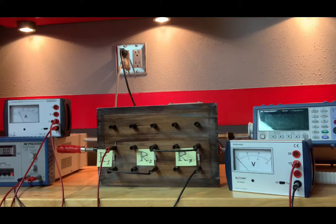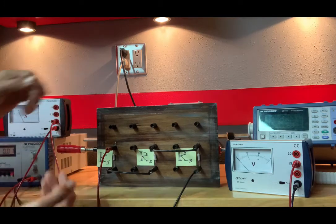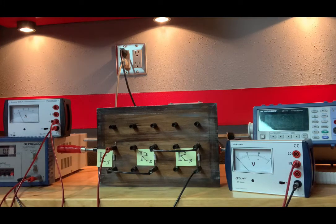By the way, the next box over to the right is resistance from equation 1. What I'm going to do in my lab manual is black that out. It doesn't make any sense that you're supposed to put something there, and it'll make sense when you complete this table. So, next thing to do is measure the voltages across different parts of this circuit. What we're going to do is first measure the voltage across R1. And I'll do that with our analog voltmeter.